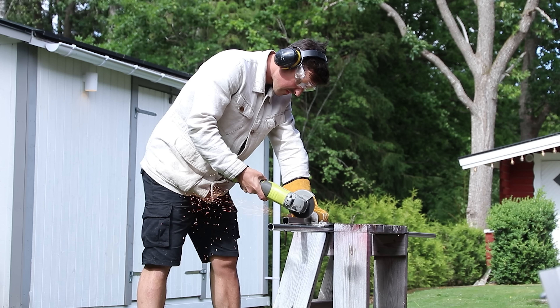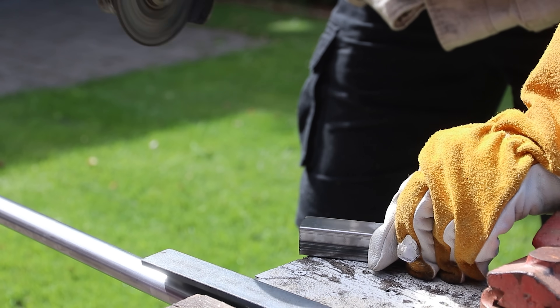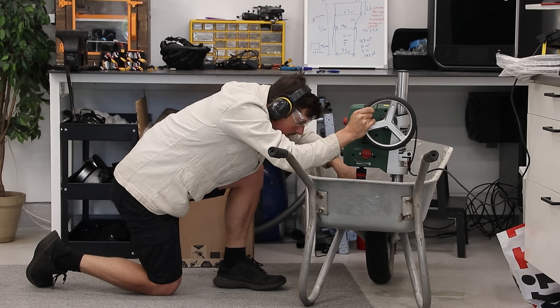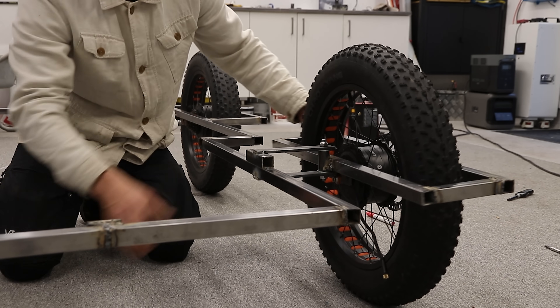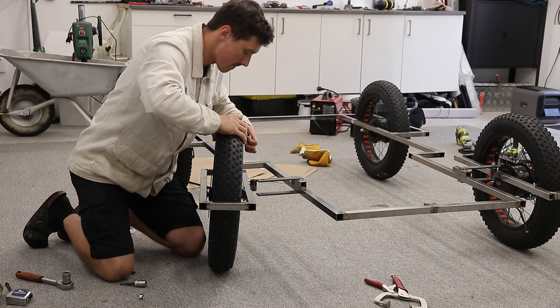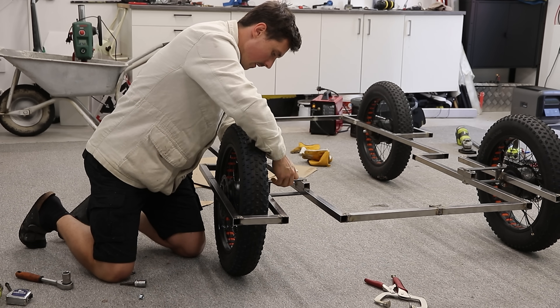The front wheels have motors too, which makes things a little more interesting. I ended up going with a pretty simple solution: two flat bar steel brackets and a 22 millimeter pipe acting as a pivot. The whole motor assembly swings on that pipe and surprisingly it all worked really well. The frame around the tire is the same 25 millimeter steel tubing. The flat bar steel holds the pipe in between and a 12 millimeter rod going through the entire assembly lets it pivot.